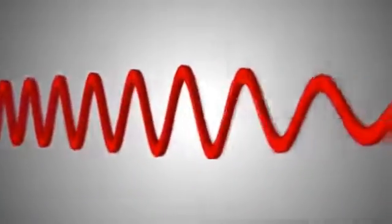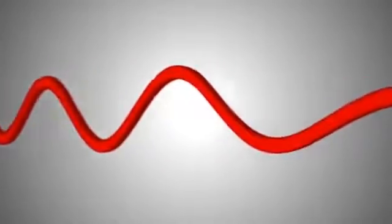The digital matrix sensor and V350 Type 5 generator specifically shapes the pulse to minimize electrode wear and decrease wire vibration. With the digitally shaped spark and the speed of the control, they've actually been able to reduce the electrode wear on the wire, thus resulting in the ability to slow the wire speed down. We've seen as much as a 60% reduction in electrode wear, which means a 60% reduction in wire cost to cut apart with no degradation in part accuracy or surface finish. This, combined with a substantial decrease in power consumption, can lead to a more than 40% reduction in overall operating costs.